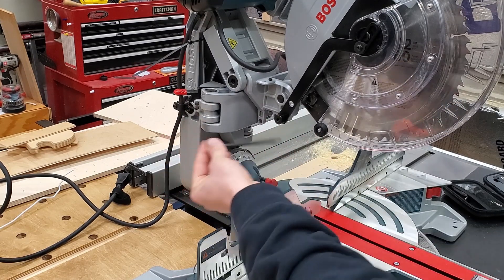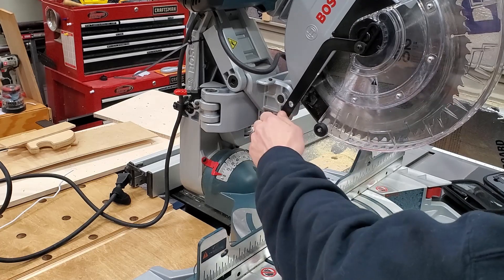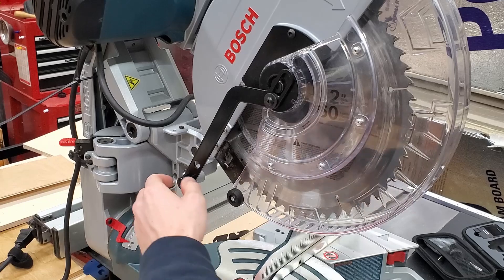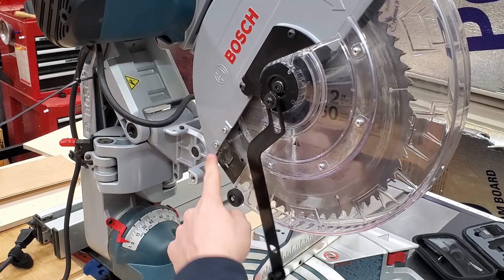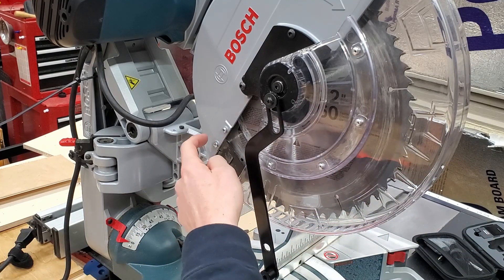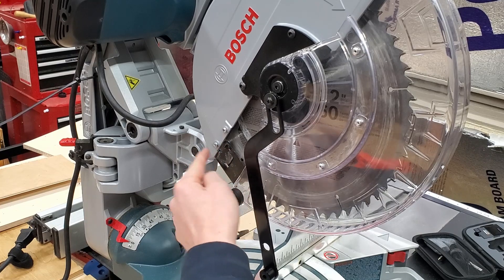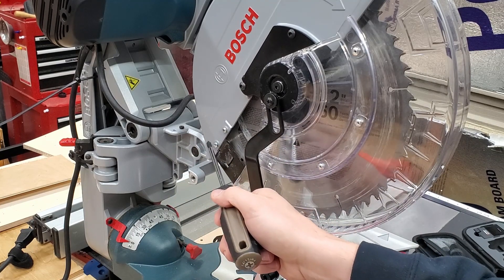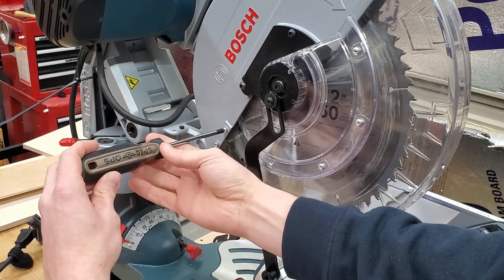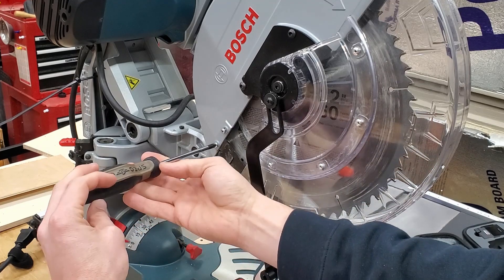Now that you've got your stock chute removed, I'm just going to take this tool and loosen up this guard bracket. I keep mine kind of finger tight, but if it's your first time loosening up, you may need to use the tool. Back that all the way out and let it hang down — that's going to allow access to these two screws. The first time you loosen these, be careful. The hole in the casting is a through hole, and there's a piece of steel behind it where the threads are. They may have paint, powder coating, or even be backfilled with epoxy, so depending on your model year, these screws can be tough to break loose for the first time. You may want to apply some heat, and don't strip them out.